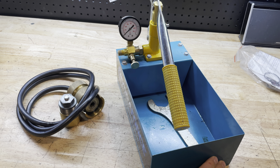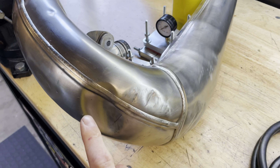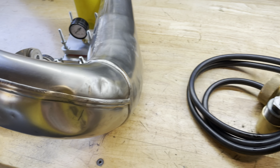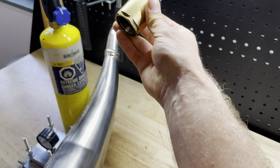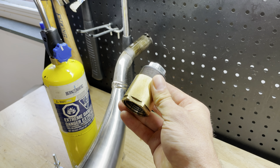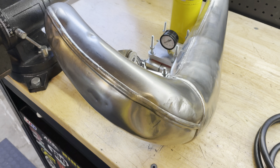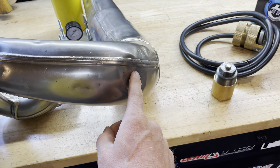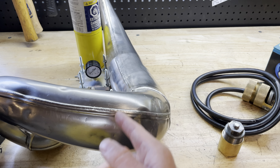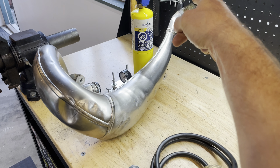There are a few things to know about it. When you use the HydroForce at 700 psi, if you have a pretty mangled pipe, you may create a pinhole — typically along a weld. Also, when you put the end caps on, you don't want to have your face over top of them. It's just water pressure, but it can shoot those caps off if they're not on tight enough. A disadvantage of the HydroForce: if you have a TPI pipe — those corrugated ones — you need a jig to hold it in place, or it'll deform and you won't be able to get the ends on properly.